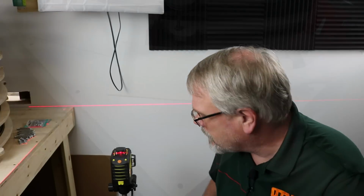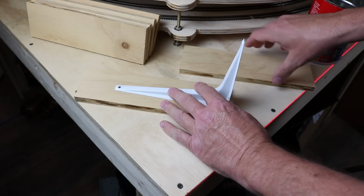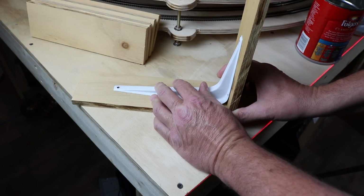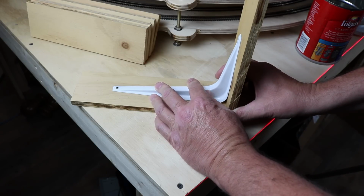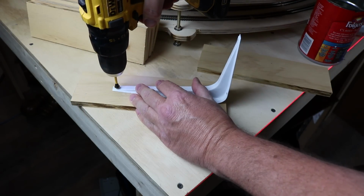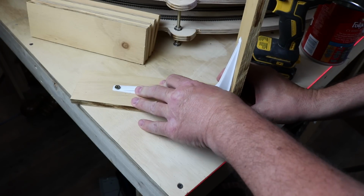So let's go. I have built shelf-type bench work using much larger shelf brackets on the entire upper deck of my layout, so I figured out some ways to make this work quite well. I like to have a wood cleat on top of the shelf bracket to screw my sub roadbed to. In this case, I had some long strips of 1/2-inch plywood left over from another project, so I cut them to length to use for this purpose. You can also use 1x4 or other 1x lumber.